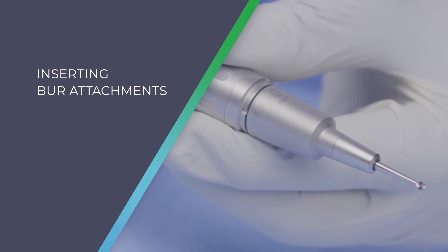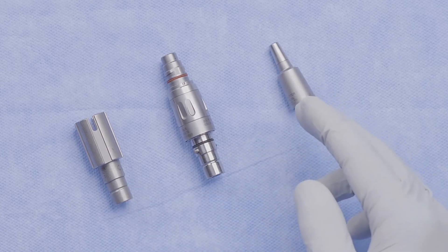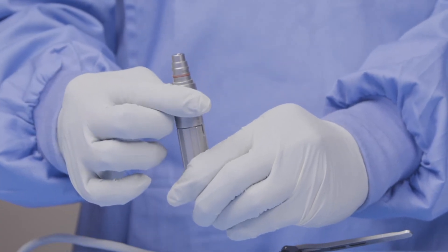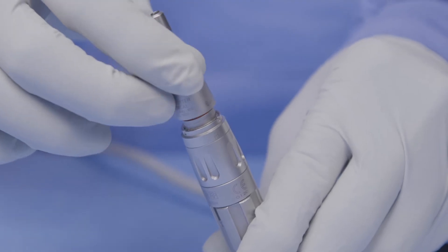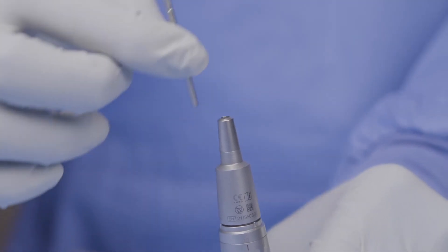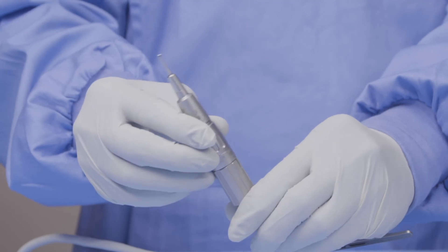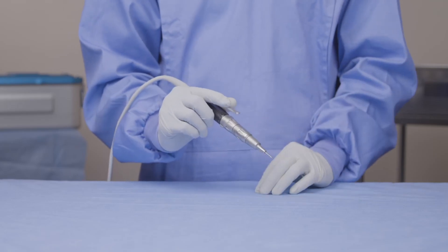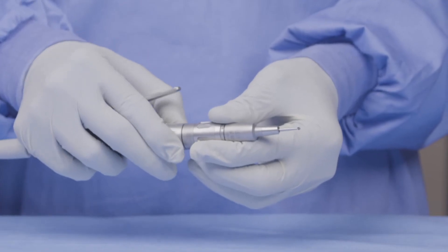Let's now look at how to attach a burr to your BI270 high speed burr attachment. On your set you will find an attachment holder, your BI270 attachment and your burr guard. Firstly, take the BI270 and place it into the attachment holder. You will then need to open the locking collar by twisting and firmly clicking open. Take your burr guard and slide it over the nose of the attachment and turn clockwise to lock into position. Then take your straight shank burr, place it into the nose of the tool and twist the locking collar back to the lock position. You can now remove it from the attachment holder and place the whole attachment into your handpiece. Once finished with the burr, place the tool back into safe mode and twist the locking collar to release the attachment.